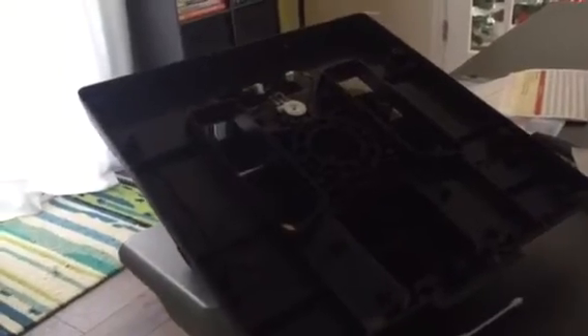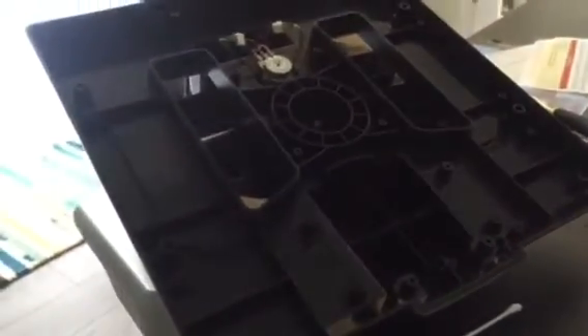These are the bottom of the pedals. I've taken the back plate off — there are 19 Phillips screws that you can access from the back of the panel. You just take all those off and then this back piece comes right off, and you can see this is the pot for the rudder pedals right here.